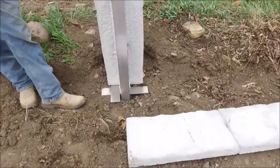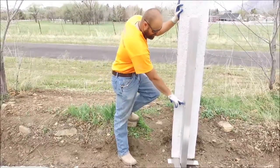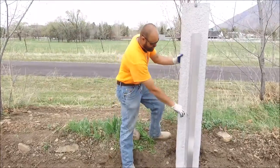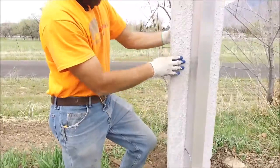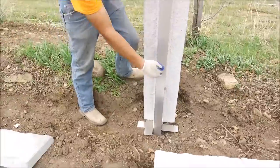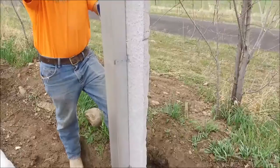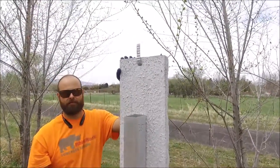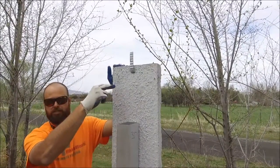When you get ready to install, start by putting all the posts on the back side that have the brick ties onto the brackets. Bend the tabs out so they stick out straight to either side of the channel. Set this post onto the wing of the T-shaped bracket and put three screws in, one in each of the brick ties, securing that post to the channel. The top tab you're going to leave bent up so when you come back to install, you'll be able to insert the foam and then bend it back down, tying it together on both sides with the concrete.